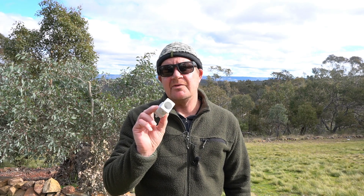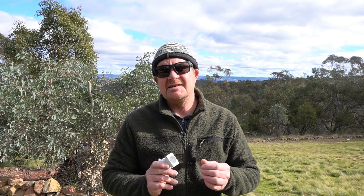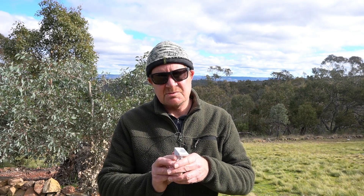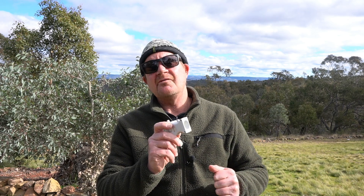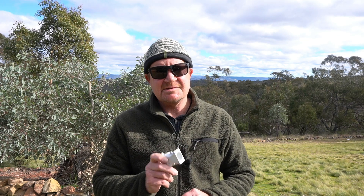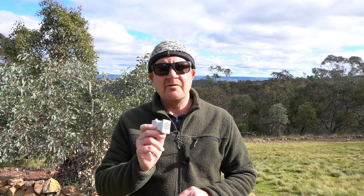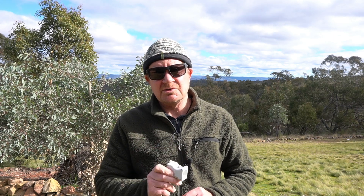These sensors have a really narrow field of about eight degrees and I've got some little cones I'm going to extend on them as well. They're going to go around the outside of my corrector plate on the telescope and they're going to be shooting through the window. The way these ultrasonic sensors work is they emit a very high frequency and listen for that frequency to come back — they're often used to detect the distance of objects, but these ones also have a switch mode. I had to wait for these to come into the country, which is another reason it took quite a while.